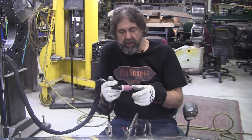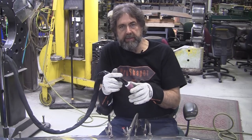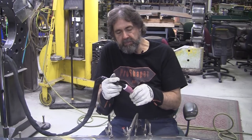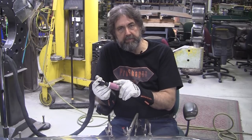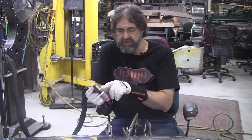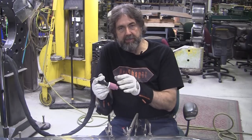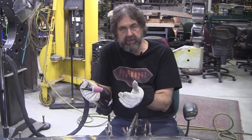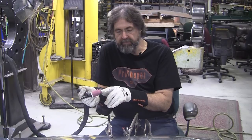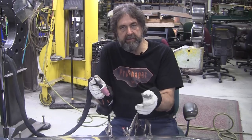And I also had two students recently, Joey Allen from Pennsylvania, who's got a lot of TIG welding experience, mostly steel, but he's got a lot of aluminum too. And he said, you know, you might be better off using a bigger cup. I had a number 8 cup before. And I found out that number 8 was the biggest cup you can get for this small format TIG torch. It's an air-cooled one. But I didn't know that they actually make a larger gas lens, and that was with a gas lens on the smaller format. This is the larger gas lens cup, and I've adopted that, and this past weekend we've had some really good welding results. Consistent time after time after time.